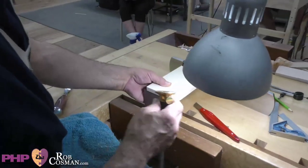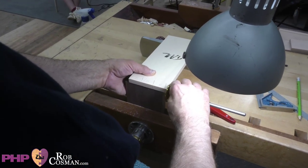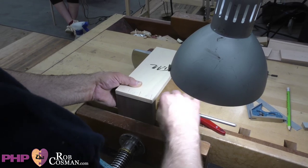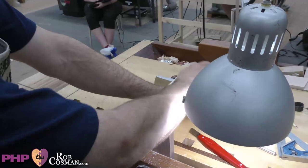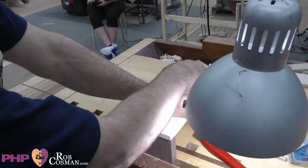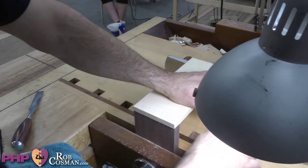Move it all the way over. The cutter has to come up underneath. Got to make sure that the head of the tool is laying flat against the side. So be nice and comfortable before you slide that over until it touches. Now hold that firmly. I always make sure that the plane is far enough back that the surface area that the pressure of the hand is being applied to, which means what's touching the plane here and what's touching here, is at a minimum so that it does not move this part of this board.